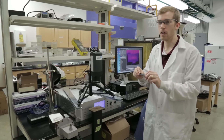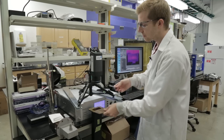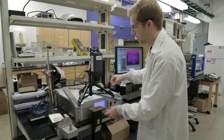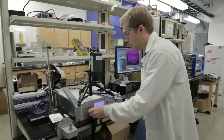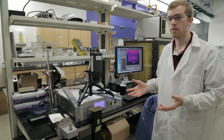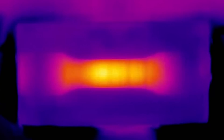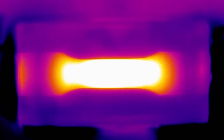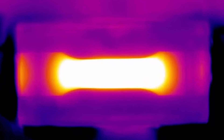Once we have something printed out, we'll put it in here and do a heat treatment to determine how long and at what temperature we need to heat our parts in order to weld them together very efficiently. We monitor this using an infrared camera, so while we're doing the heat treatment, we're actually watching the part in real time and measuring its heat signature to precisely determine the temperature and the thermal history that our process has applied to the 3D printed part.